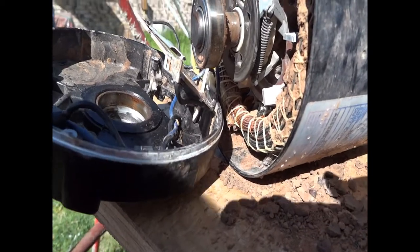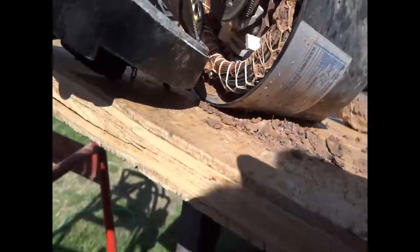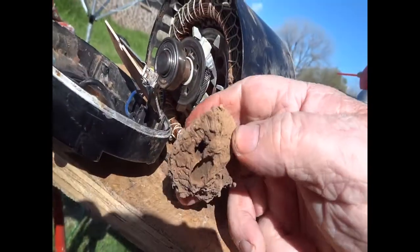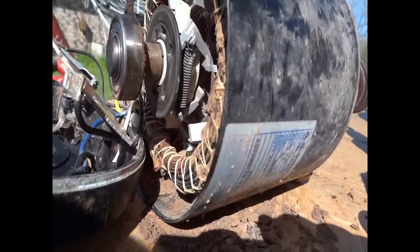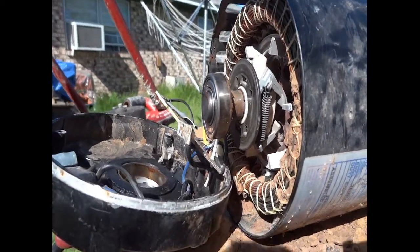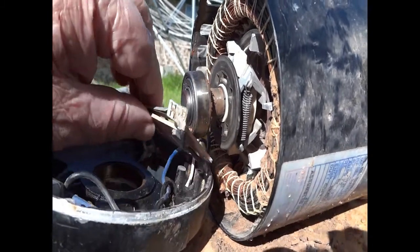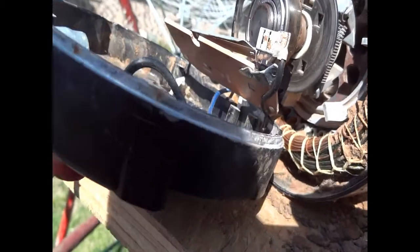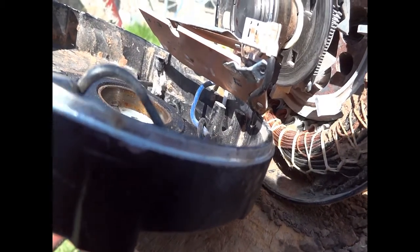Yard, where today we're fixing the cement mixer. It seems that the hornets were nesting in the motor, and that's preventing the start switch from kicking over. So just a general clean out of the back of this, and to polish the contacts of the start switch with some fine sandpaper, and she'll run again for another few years.